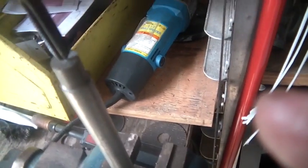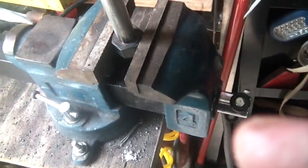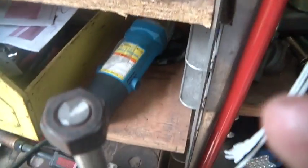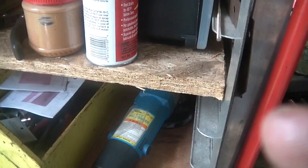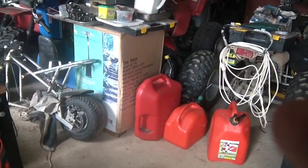Once the nut is welded on and you have the hole drilled, it's easy enough to tap it out. I ended up using a 5/16 bolt — perhaps a little bigger than necessary; a quarter-20 probably would have been plenty, because there's really nothing going on there in any direction. It's just kind of keeping everything in place. So there we are. Probably next time you see it I'll have the spacers cut and installed, the engine on there, and I can start lining up the chain.